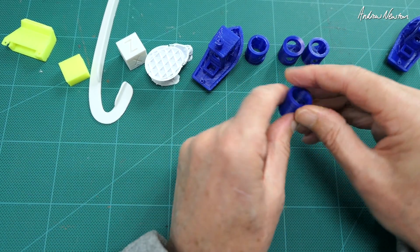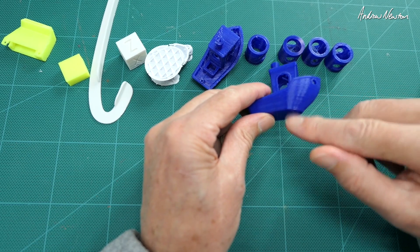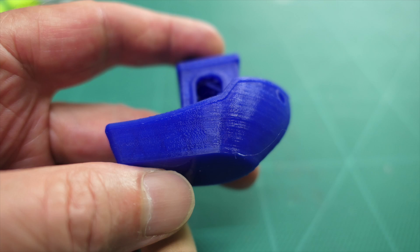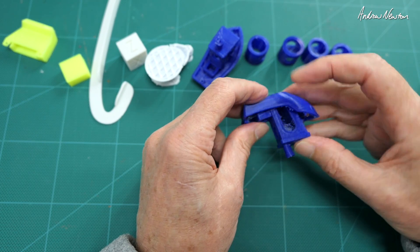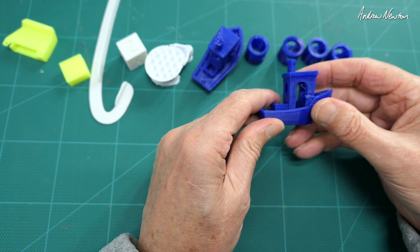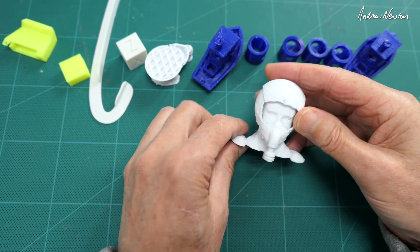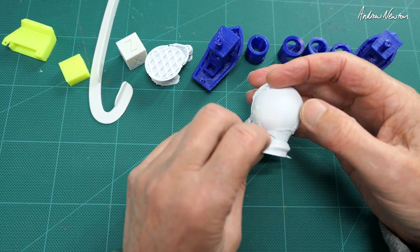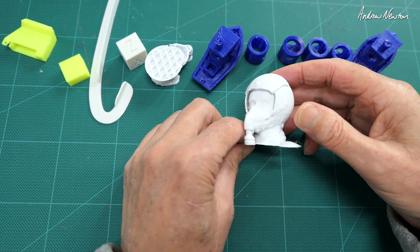I'm very happy with that — it's looking much nicer. Reprinted the benchy and yeah, much better — that's a good-looking benchy on the outside. A few little ripples and a little bit of stringing, but this is only a budget-priced printer so you wouldn't expect extreme quality. Reprinted the little pilot's head and yes, we don't have any of the cross-hatching on the outside — the infill lines are staying internal, which is where they're meant to be.